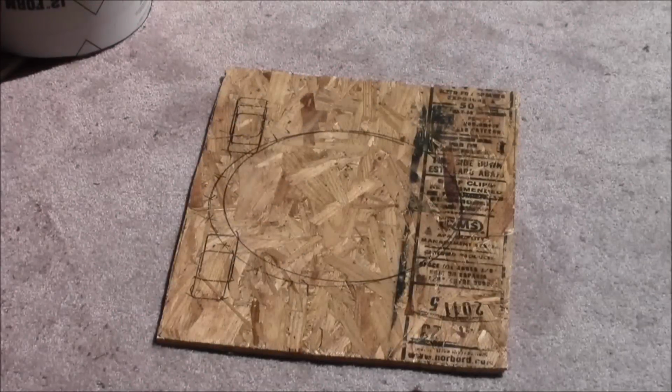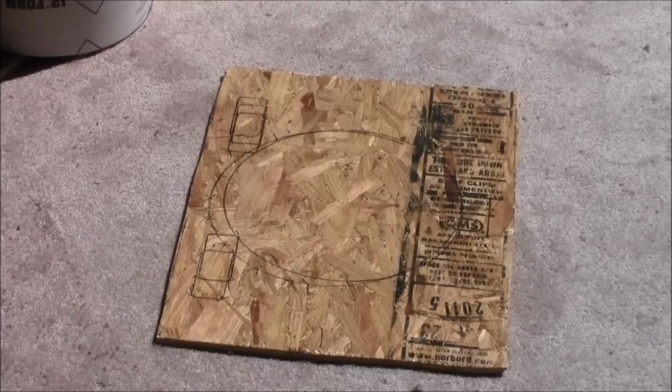I'd recommend drawing out the design first. As you can see, the placing of where I'm going to put things changed once or twice. We're going to shoot 3 sheets of plywood. So I'm going to fasten the first 2 together, and we're going to do that with sheetrock screws.